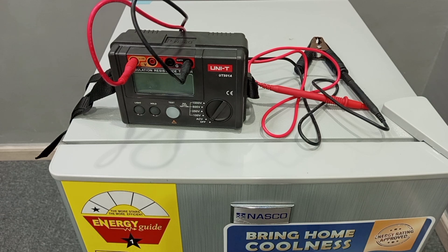The higher the insulation resistance test value, the stronger the insulation on the cables. If the insulation resistance test value is low, it means that the insulation on the cables is weak and it can't resist the flow of current as it is required to do. In that situation, there can be leakage in the system.